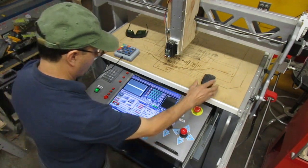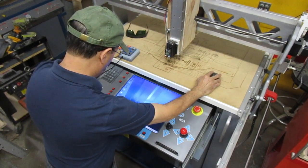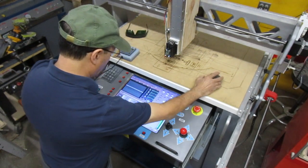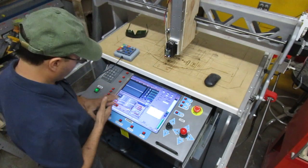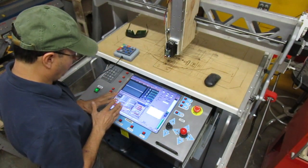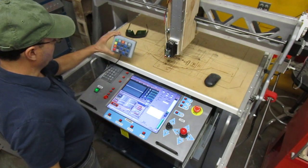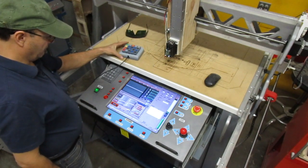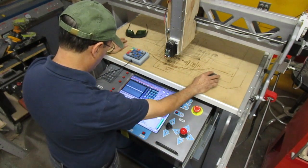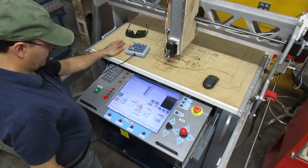So we're gonna do this programming here, and we're gonna open right here the Mach 3 screen. And the default screen is the 1024 screen, so this is the one we're gonna modify, and then we'll save it as the CNC Pendant file, right? So okay, let's start doing the programming on it again. It'll be real quick. Image button, and then it should load.